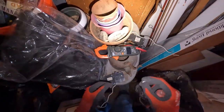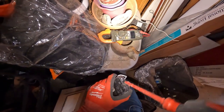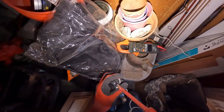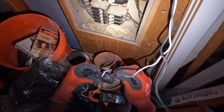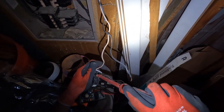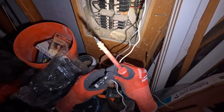Probably what I'm going to do is go ahead and connect that neutral on there while I have this breaker out, because it gets a little tight in there. Once you get the breaker in there, it's a little tight to get your screwdriver in there and get that wire in. So I'm going to go ahead and put it underneath here right now, and go ahead and put my hot underneath there also.